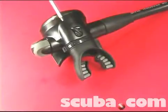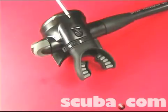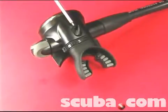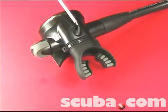This is the pre-dive dive switch. Placing the switch to the left position reduces or eliminates the possibility of high volume free flow when the mouthpiece is not in your mouth. Placing the switch to the right position provides optimum performance during a dive.